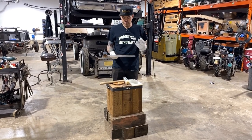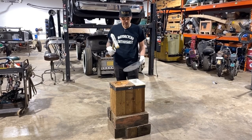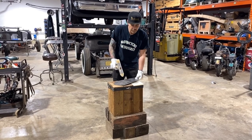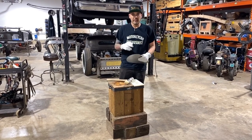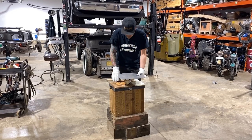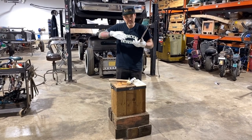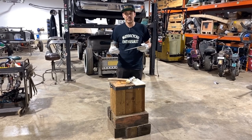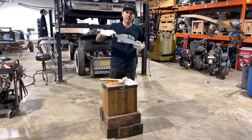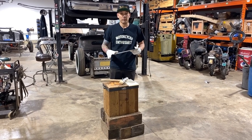The amount of shrinking you can get by just using brute force and a stump like this is actually pretty incredible. Today I'm showing tuck shrinking and a little bit of stretching. When you hit with the sharper side of the hammer with the void on the back side, it makes those little golf ball impressions — that's stretching. When you create a wrinkle close to an edge sitting within the bowl, held on both sides, and smash that wrinkle out, it forces the metal together and shrinks it. We can actually show with a micrometer how the edge gets two to four thousandths of an inch thicker than a flat sheet.